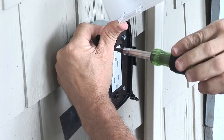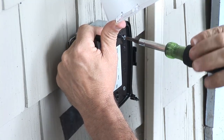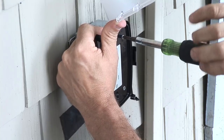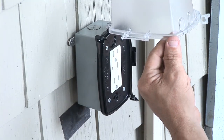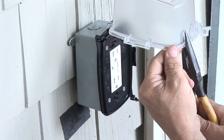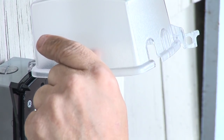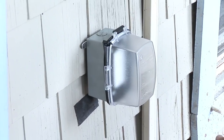Our main goal is to make sure that everything is sealed inside the box so that no rain, water, or bugs get inside. Depending on what you're going to plug in, this cover comes with preformed knockouts — use your needle nose pliers to remove them. Now you can plug in your device and that finishes the installation of an outdoor outlet. I'm Nick Morrow with CJSElectric7.com and that is how you install a power outlet outside. If you have any doubts, please contact a local professional in your area. Thank you.